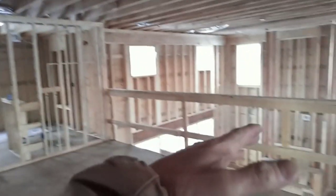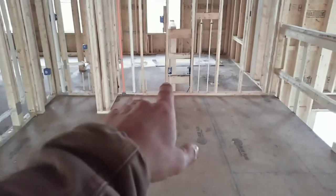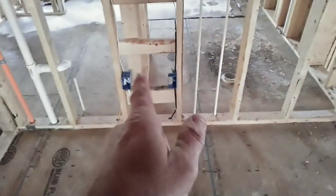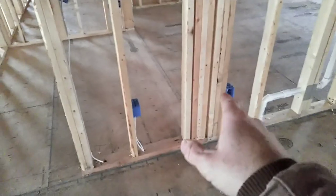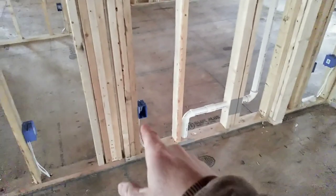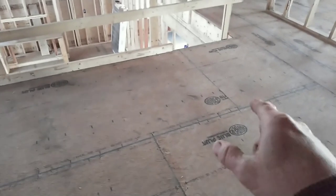This loft area they're going to use as a gaming or game room — it's open to the downstairs living room. This is a closet. They chose to do an end-of-wall TV box. I've got my 120 volt and my low voltage box supplying the end-of-wall TV box. This outlet has to be within six feet from the edge of that doorway, and I have to be within six feet to the edge of there. This outlet has got to be within six feet from the edge of that doorway and within six feet from the edge of that closet door — so I got away with one outlet on that wall and one on the other. I suggested a floor outlet for a sectional or love seat with a table lamp, but the owner chose not to.